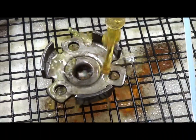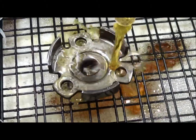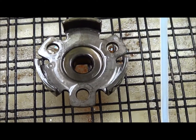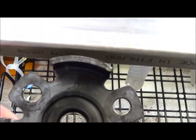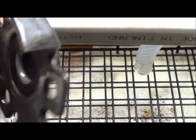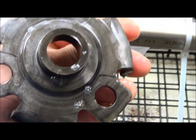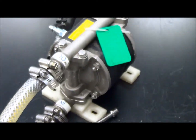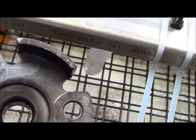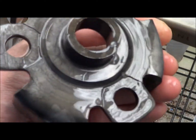We flipped it over now, and much of the rust even on the bottom is already loosened up. In not even an hour, this part that was rusty over much of its surface is now completely de-rusted. All we did in our little experiment was use this little air-driven diaphragm pump to flow Evapo-Rust over the surface. We moved it once, flipped it over, and that was all it took.